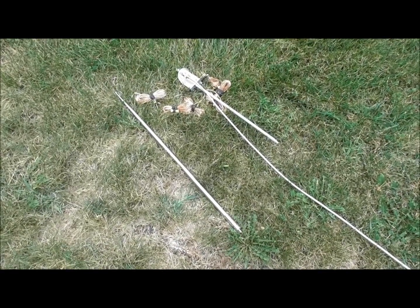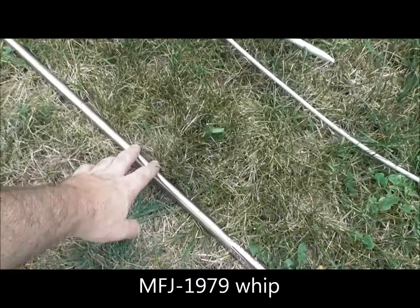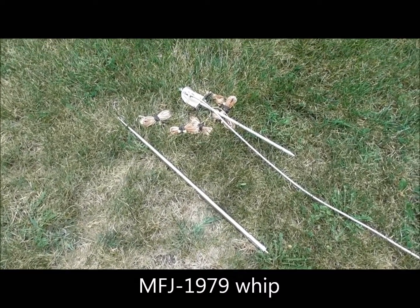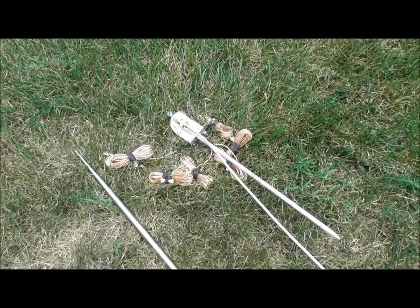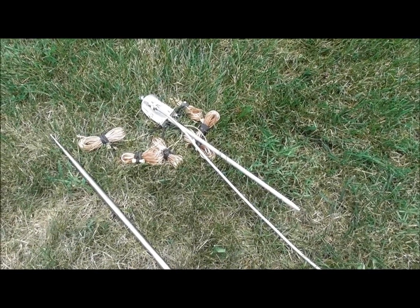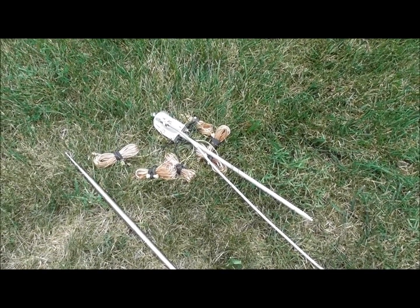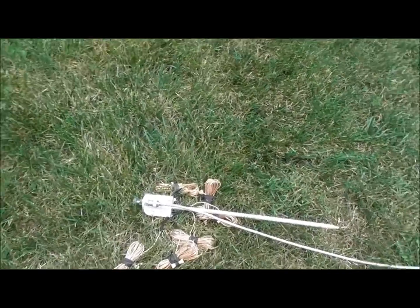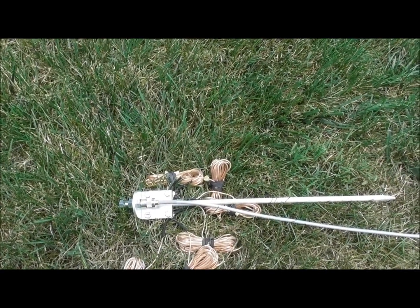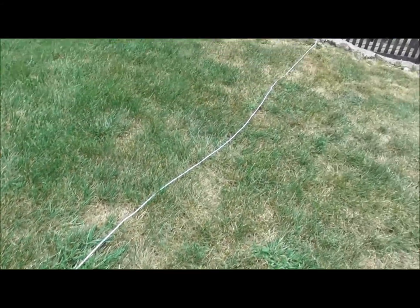Here's a look at the antenna components. What we have here is a telescoping stainless steel whip made by MFJ. What looks like speaker wire or lamp cord will be my ground radials. Then we have the spike that we drive into the ground — that's just made from a piece of aluminum rod with a point filed on the end, picked up at Lowe's or Home Depot. Then there's a CB antenna mount, which is what we use for attaching the vertical to the ground spike.